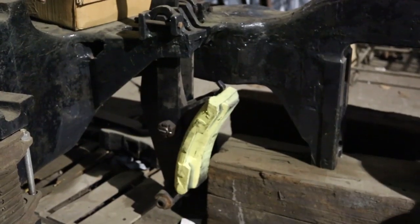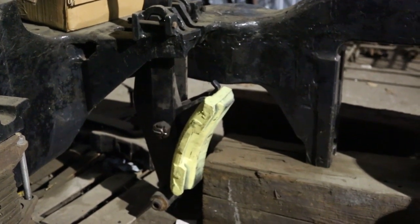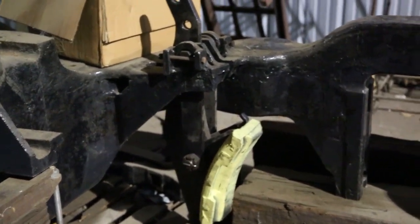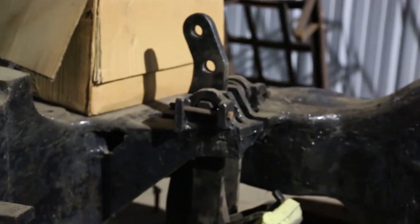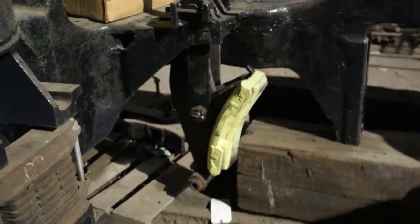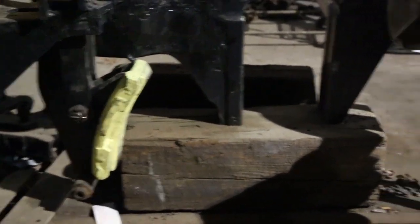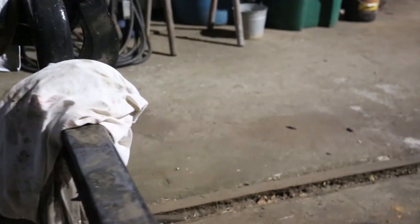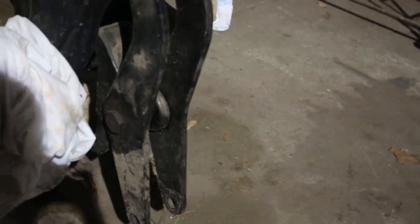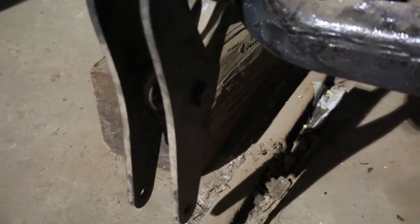Of course, another major part of the truck is the brake rigging, and this is one of the inside brake hangers. We haven't set the brake cylinders on, but the brake cylinder engages the top of that brake hanger right there. And then there's also brake straps which connect that brake hanger and brake shoe to the outside one, which is hanging here behind all these rags and junk. You can see it better on this one if I don't make you dizzy with my swinging around.